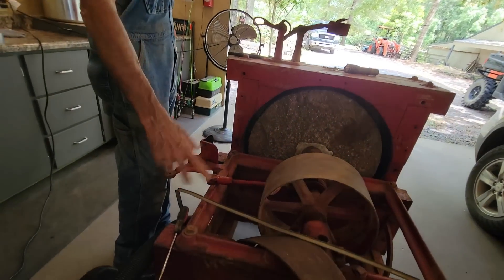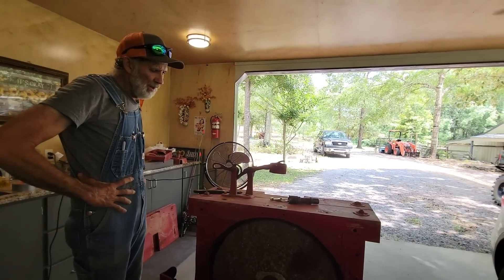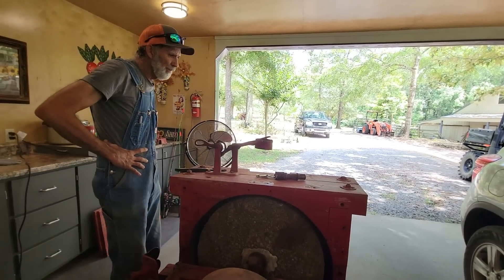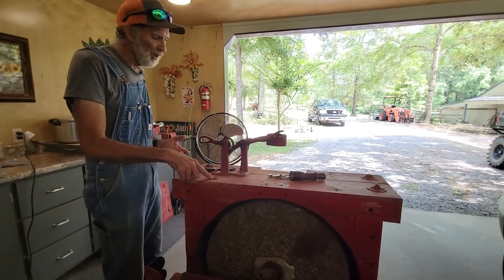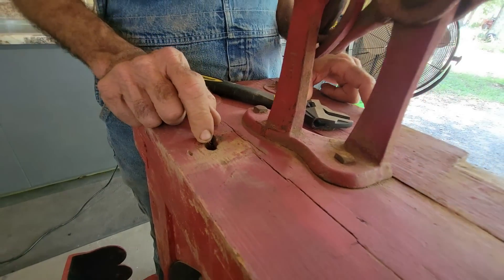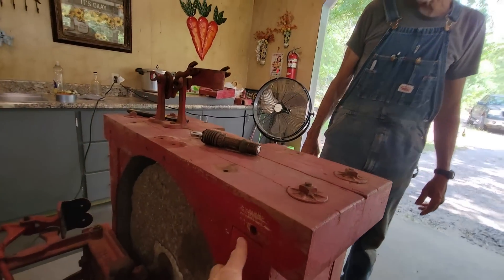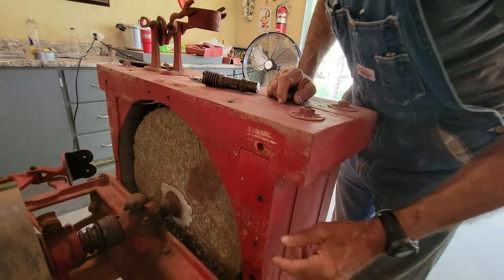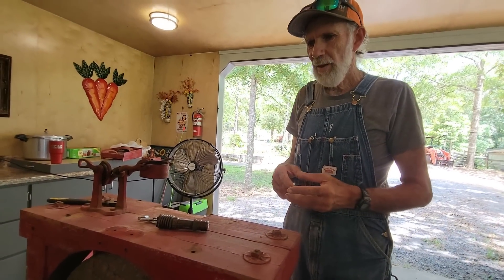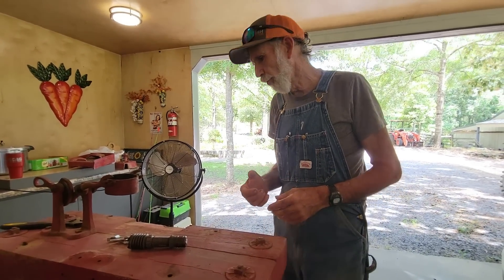As far as the metal parts, I was going to paint them black, but I don't know if I'm going to, because there's something about it that just looks antique like it is, and if I go and mess with that it takes away from it. Now there's some things I'll do — like there are some rotted out or stripped out bolt holes up here in the top. I'll have to go back and fix these so I can put new bolts in where they won't be stripped out. I'll re-drill them and put new bolts in. All these bolts are okay — fantastic. I bought brand new ones for the little bolts holding all this on, because the old ones, even though they're lag bolts, the threads had rusted some and they don't have the gripping power they used to. So I'm going to replace all of those.